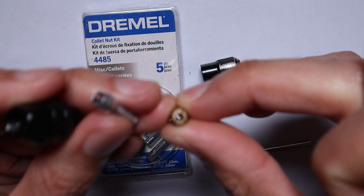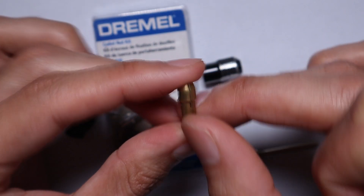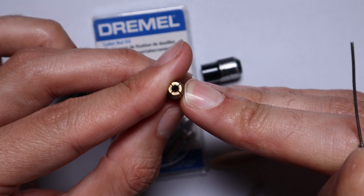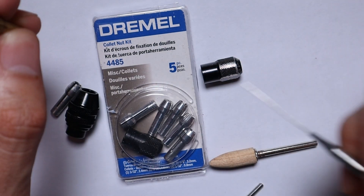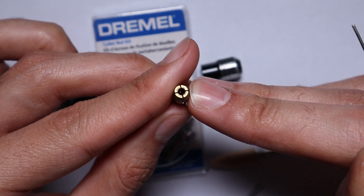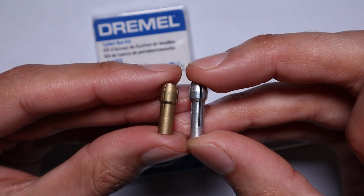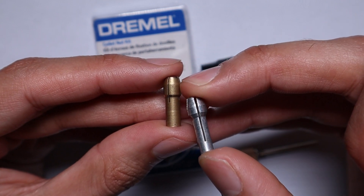The collets - I've got a whole kit here but this is the one that came originally with my tool and I'm still using it. It's an absolute workhorse that I used for a very long time and it's pretty much completely undamaged. As long as you tighten them correctly and use the right one for the right shank, you've got no problems. You'll rarely ever need to replace these. The ones that come with your tool will probably last as long as the tool itself. You can get them in brass, stainless, or other materials - just be mindful that over-tightening can damage the collet if it's softer than the shank, or damage the shank itself.